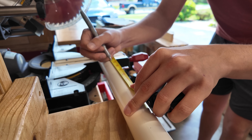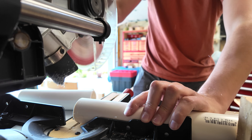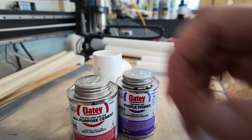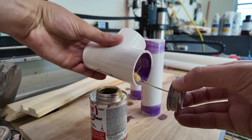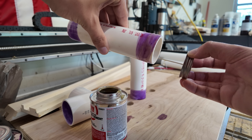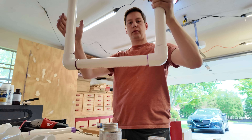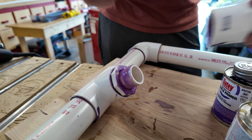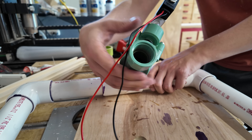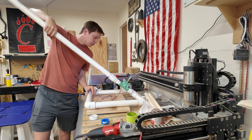The pneumatic design starts off with a trip to the hardware store to pick out a bunch of PVC pipe and fittings. This system is really a crossover between a potato cannon and a pneumatic actuator, and this whole thing is built by just cutting down all this pipe and fitting it together with a bunch of PVC fittings. If you've never worked with PVC before, this purple stuff is actually a cleaner for the pipe, and then the glue gets applied to both sides of the joint. When you put these together the glue bonds almost instantly and actually fuses the plastic together. All of this pipe and fittings forms what will be the base of the launcher and will also act as the air tank. When a switch is pressed, all of the air from this tank will rush into the cylinder and basically push or yeet the plane into the air. Releasing all this air is done by this valve which screws into place — it's normally just meant for sprinkler systems and can be actuated with a 12-volt signal. On the other end of the valve, the barrel or cylinder just screws into place, and at this point we essentially just have a potato cannon.